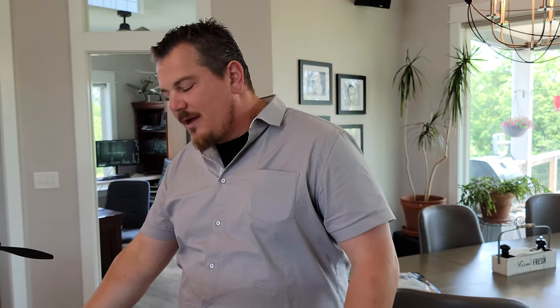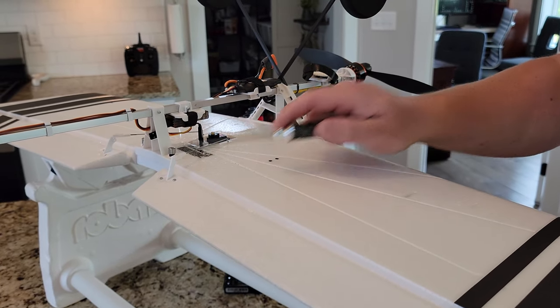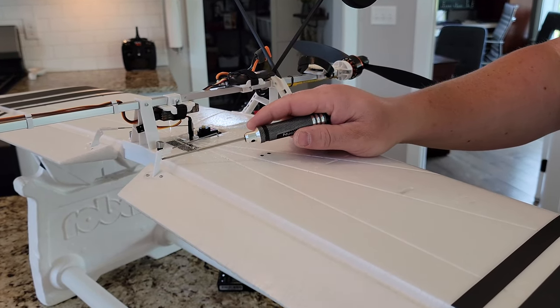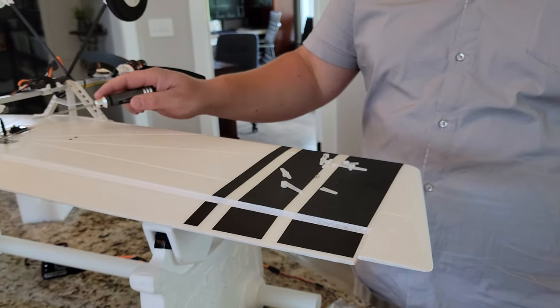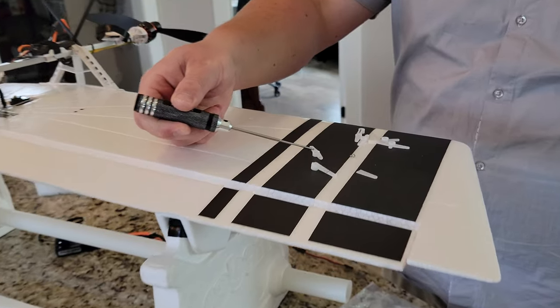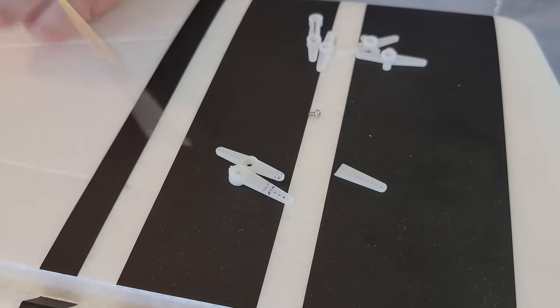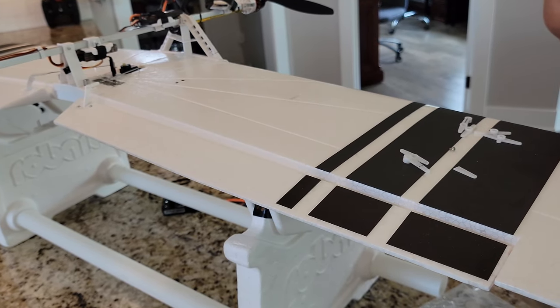The other thing you could do is you could go inboard more and you could change from the outside hole to the more inside hole, okay? What that's gonna do for you is you will change the amount of output here without changing the length here, okay? So if you go inboard here by a number of holes there, you get symmetry. And then you bring it from the outside to the next one in, or to the next one even still. So what that does is you change the length, but you keep the same output.